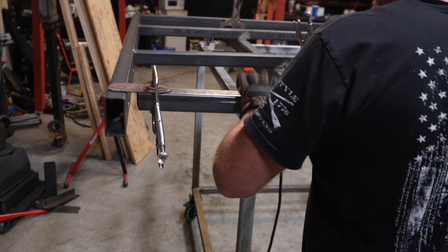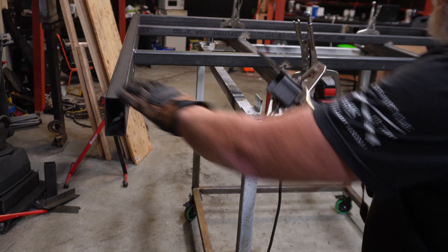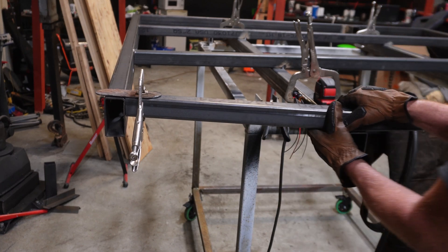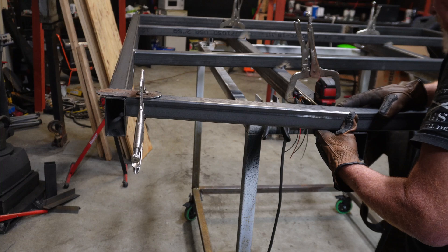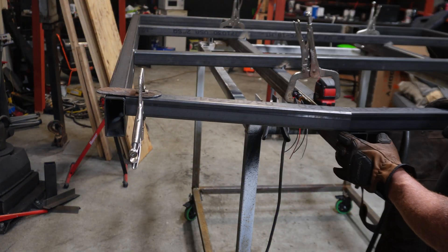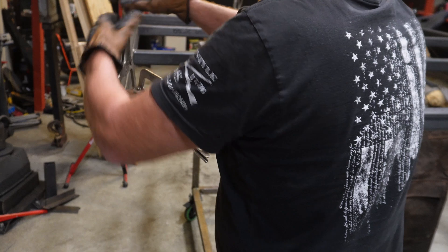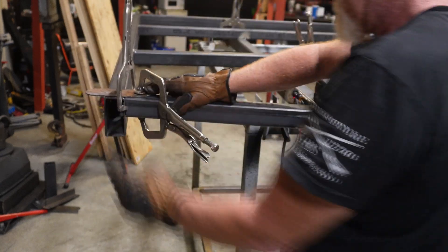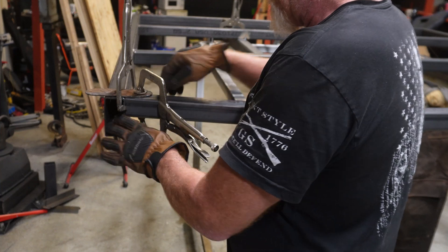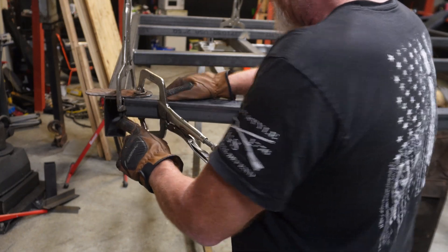Now on this corner piece, I have these little tail light cut-outs all over my shop. We're going to clamp that on there to hold this level with this — set it on here like that, hold it into place, and we're going to tack it. Once you've got the back side of this tacked, we're going to move to this side. We're going to leave this flush so it's flush with this, then grab another clamp and pull this in so that this edge is flush when we put this together and go ahead and tack that.